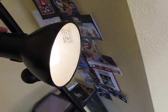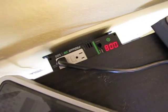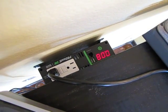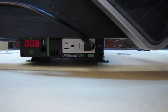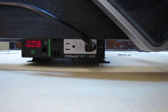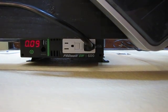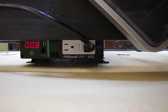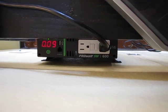I've kind of tested this out pretty well. If I turn all of these on, that's a pretty decent load. As you can see the voltage drops a little bit. It'll still run pretty good until about 11.9 to 11.5 volts, then there'll be a low voltage alarm that'll come on and then it'll shut itself off.